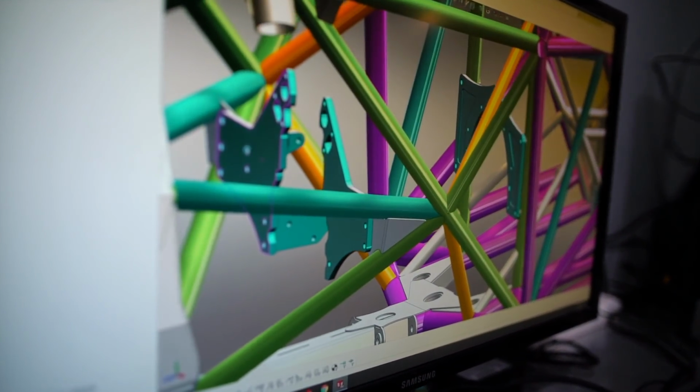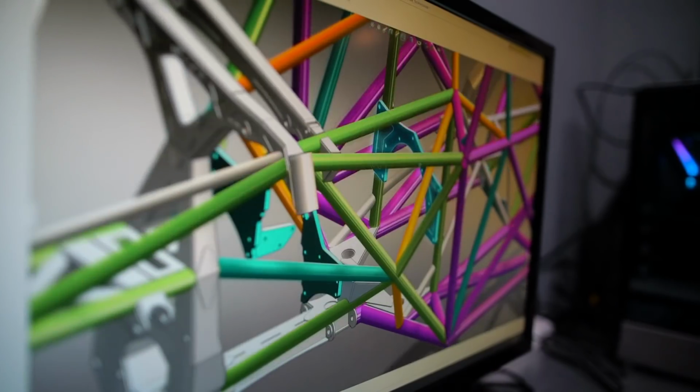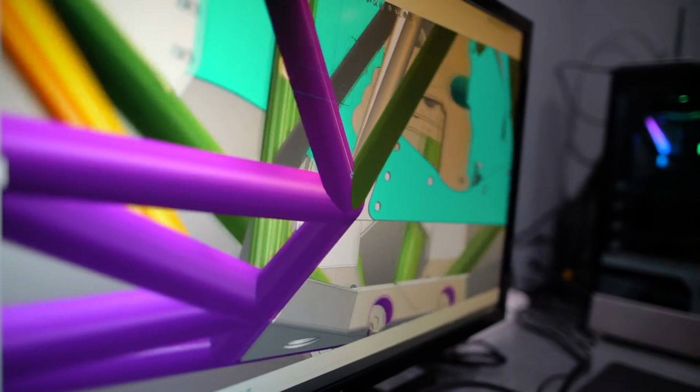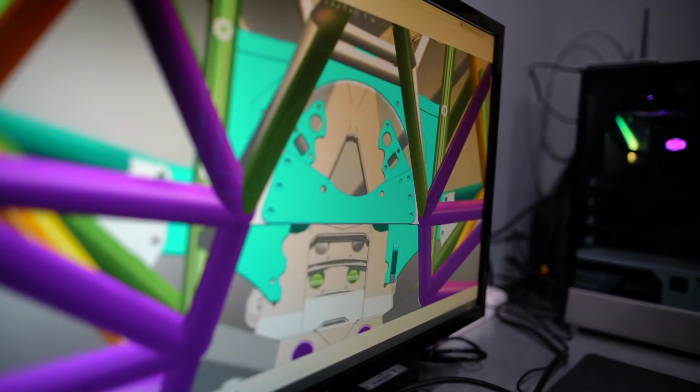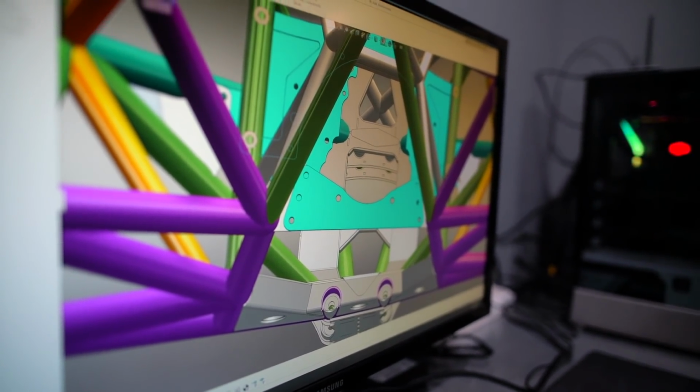You can see all the engine plates highlighted in this teal color where it'll bolt to. So we have a front plate, we have a mid-mount plate, and then we also have the rear Fortin underdrive plate right there. That was all cut out as well by precision tube laser out of half-inch thick 7075 aluminum.